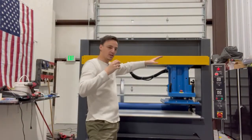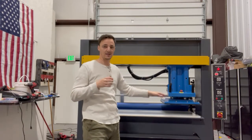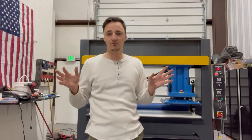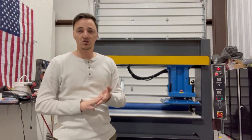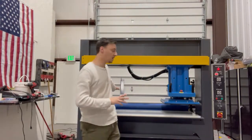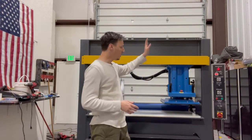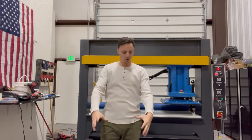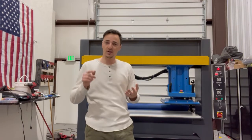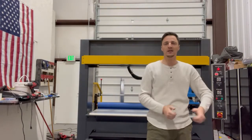What that means is the machine's going to go make its compressions and sidestep, then it will advance, then it will make its compressions and sidestep. This one is just like most other traveling heads you've probably worked with — it's just a manual machine, it's all operator based. There are a couple of features we've built into it. One is that pinch roller system that is advanced and retracted with a foot pedal, and the machine will do a compression and once it's done, the head will move out of the way so you can access your materials. If you configure the sidestep properly, you can kind of use it like an automatic sidestep machine. That's not its intended use, but you can kind of game it a little bit.